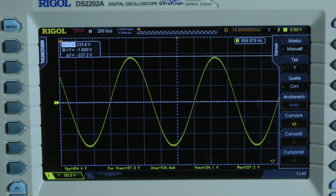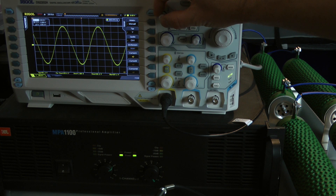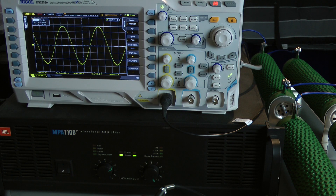We have a little bit of clipping indication, so I will reduce until there is no clipping indication and then recalculate the output power. That looks clean enough. I take the lower value: 224 volts. In this case I got 1608 watts bridged mono 16 ohms, which is around 804 watts into an 8 ohm load per channel, both channels driven into full power.